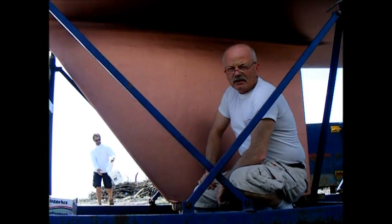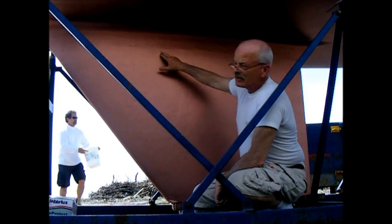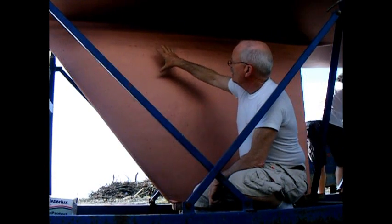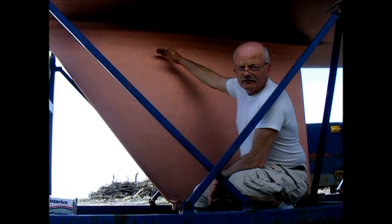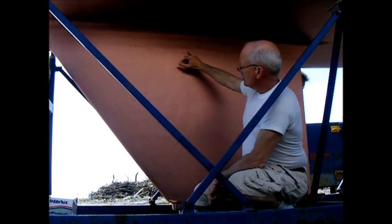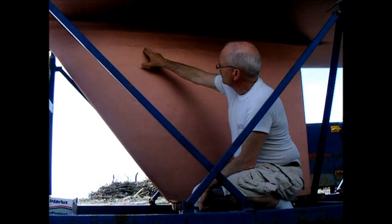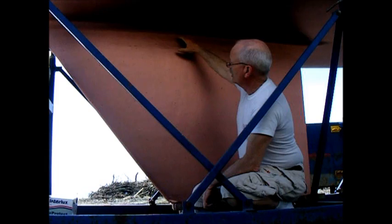One issue very common with a lot of boats is the hull keel join smile. This is caused by the lateral force on the keel, especially on a beat, trying to hold the boat from slipping sideways and generating lift to move the boat forward, causing the keel to flex in relation to the hull, and that generally creates a smile right along the joint between the lead portion of the keel and the fiberglass portion of the hull.